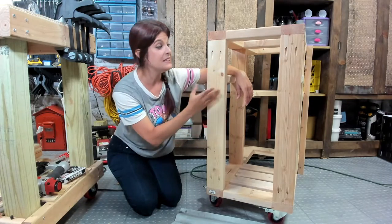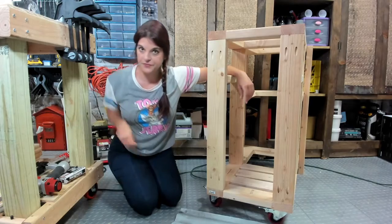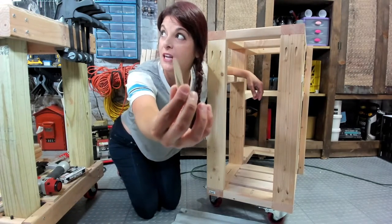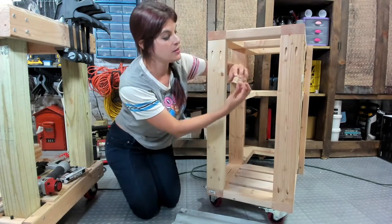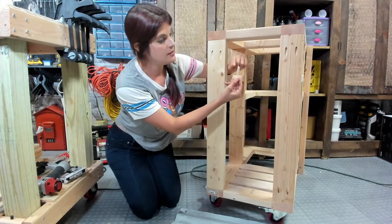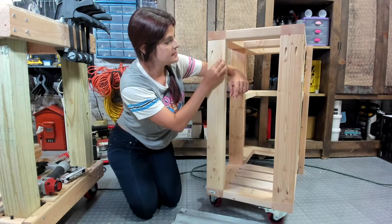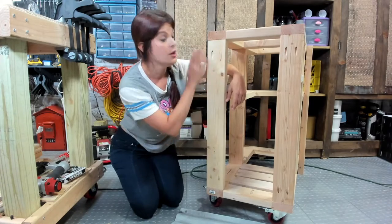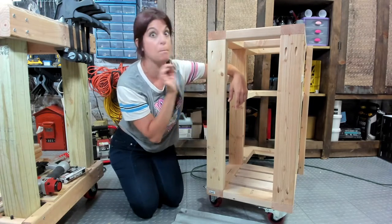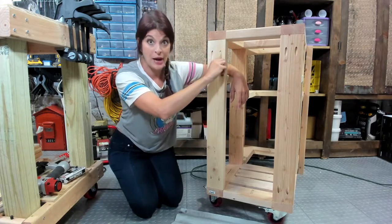So the easiest way to handle that is you can buy these little plugs. And I'll just kind of show you what that looks like. So see, it looks like that. And you just put it with the flat part facing up and the circle part in, and it plugs it right up. Look, it makes it practically disappear once it's all installed, you sand it down, stain it, and it's barely visible. So that's what I'm gonna do with these exposed pocket holes.